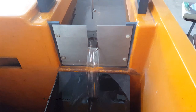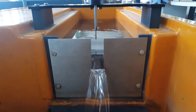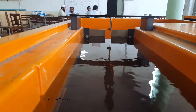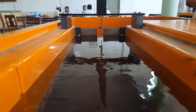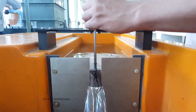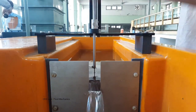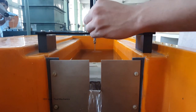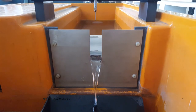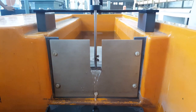As it overflows the apex, then you close the hydraulic bench so that we can measure the head up to the apex. Then you record the head up to the apex. Let it completely go down to the apex, then you move the gauge down.